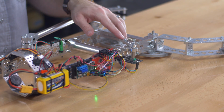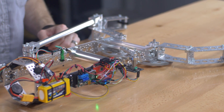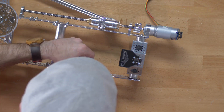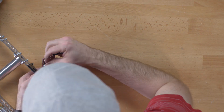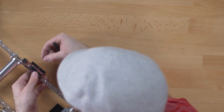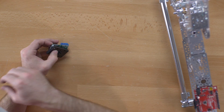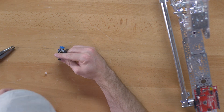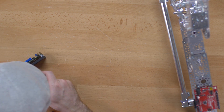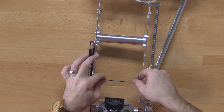I have a nice heavy-duty trigger in the form of an aluminum beam. This beam is supported by a pillow block and ultimately turns a potentiometer. That potentiometer is being monitored by an Arduino Uno-compatible SparkFun Redboard. Besides monitoring the potentiometer to tell exactly where the trigger is, the Arduino is also monitoring data from the encoder on the motor, as well as the data from two sensors. It's also sending information to a Pololu simple motor controller to actually drive the motor, since an Arduino Uno by itself is not powerful enough to drive a motor — so you're going to need some sort of motor controller. In this case I went with an external one instead of a motor controller shield. I've used this one in previous projects and really like it — it's simple, easy to use, and runs these motors really well.